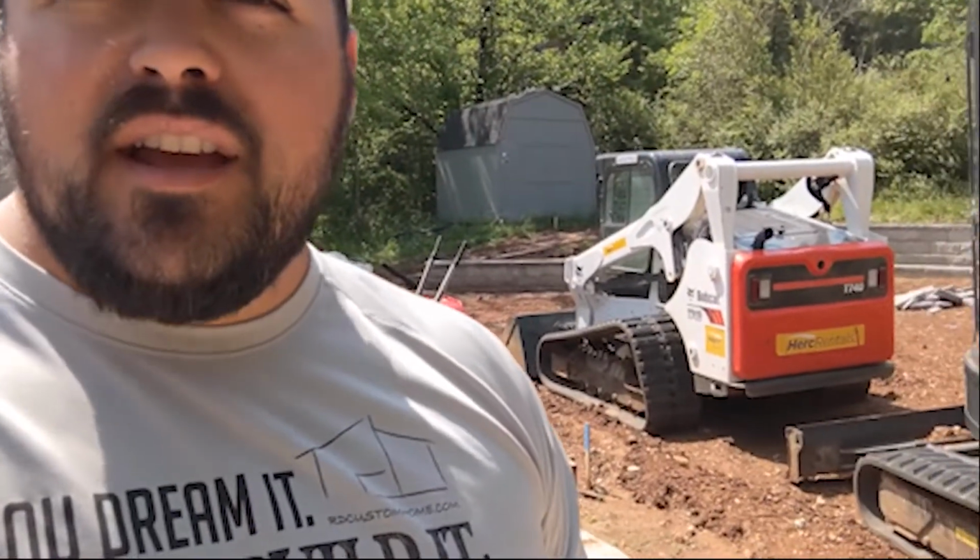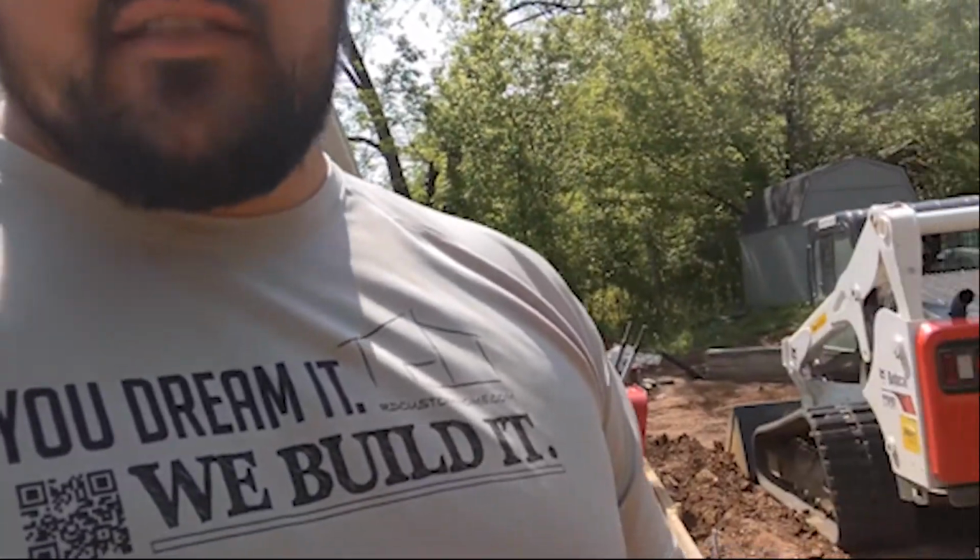We were going to have a longer day today. Today on the schedule, we did plan on doing the first bit of material removal and trenching for the French drain that's going to be installed through the middle of this yard. However, this morning it did rain like crazy, and as you've seen from previous videos, this site is a nightmare with clay, and it does turn into a mud pit disaster. These track machines would have handled that no problem, but it would have been very messy.